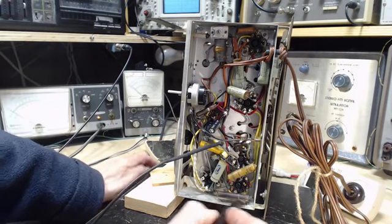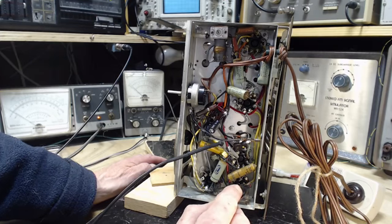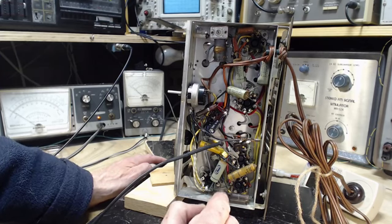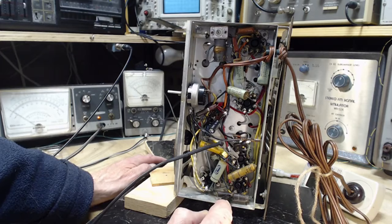If we look at pin 8 right away, 2, 2, and around 20. This is 220 ohms. So this is probably the cathode resistor. What's this great big one then? What's this big guy? This might be the heater. This might be the heater resistor. There shouldn't be a heater resistor in here.